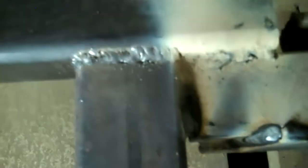Alright, there we go. All the elements that every welder hates. Uphill, upside down, and sideways uphill. Everybody hates it. It's not that bad if you learn how to chase that weld or push it. So there we go. That's welded in. That ain't going nowhere. Then the bumper will bolt to these legs here, weld to these legs. I'll get to that next.